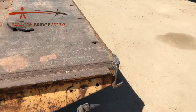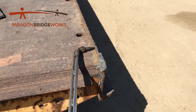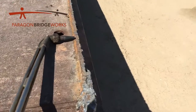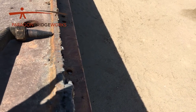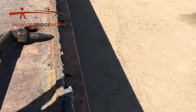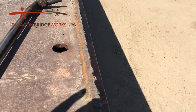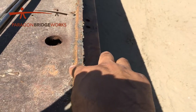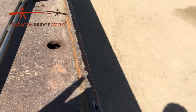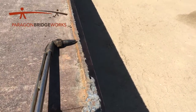So this is one that we've cut. You can see the torch was placed here and we just dragged it all the way down. You can actually see that the top of the weld bead was cut a little bit here. This is even better where we kept it about a quarter inch above — there's only a quarter inch height there. So that's really good; that's preferably the way we want it right there, and we just cut all the way down.